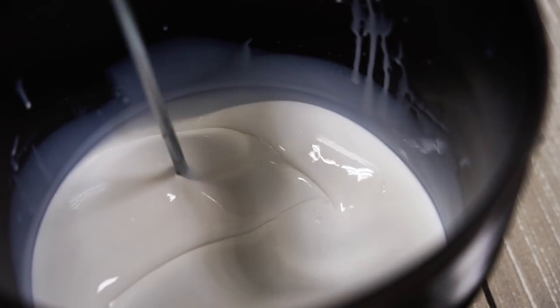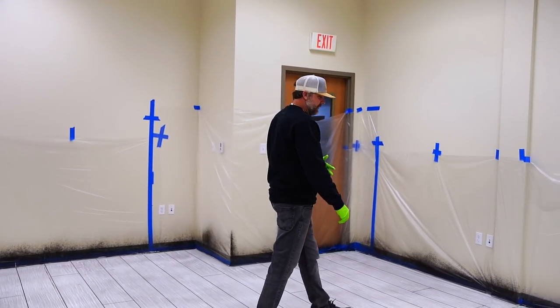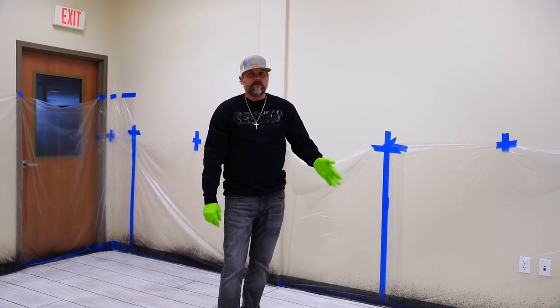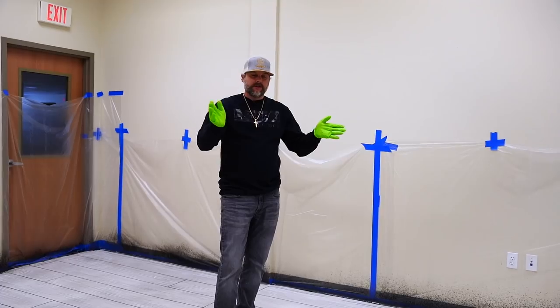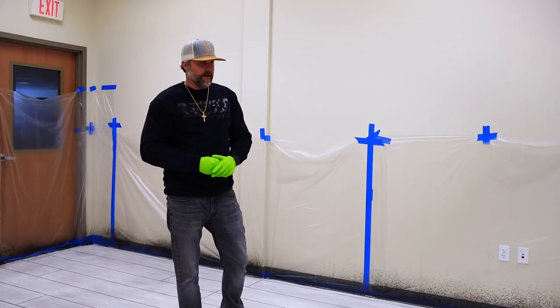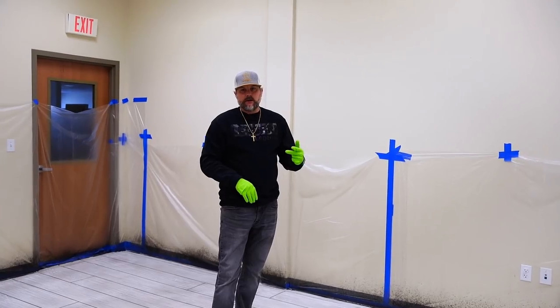So when we're applying the top coat, typically we want to roll with the grain, right? Because if you get a roller line or something, it's going to be less noticeable if you're going with the flow of the grain versus if we were going this way, a sideways roller line. Typically, we don't have any issues with roller lines in overlays because they soak it in a lot. So we do two coats of the urethane.